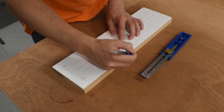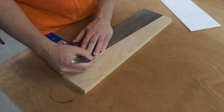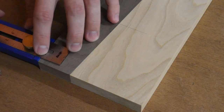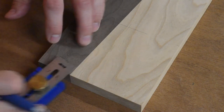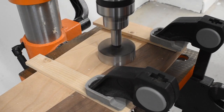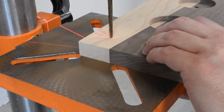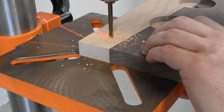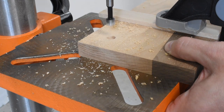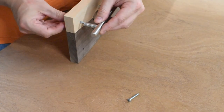Here I'm transferring my measurements from the template to the wood so I knew exactly where to put all the marks to drill the holes and bore them out with a Forstner bit. The hardware was attached to the ends exactly one inch from either side. Here I'm boring out the holes with the Forstner bit. I think I'm going to go with a router template next time — the Forstner bit was definitely bogging down and I didn't really like that divot in the middle. I hadn't thought about that beforehand, but hindsight is 20-20 — I think it turned out pretty good. Here I'm insetting the holes for the screws so the screw head isn't sticking out the bottom and scraping on the table.